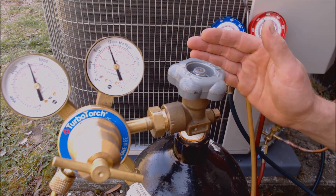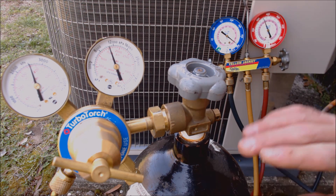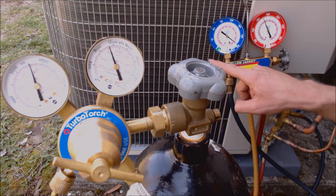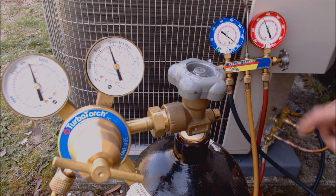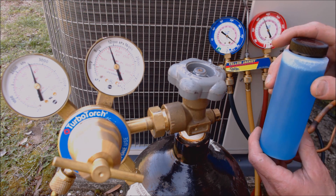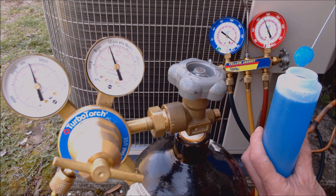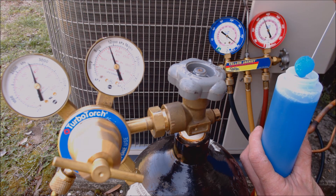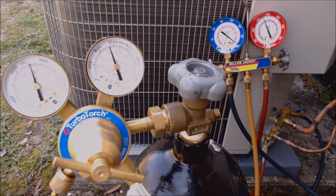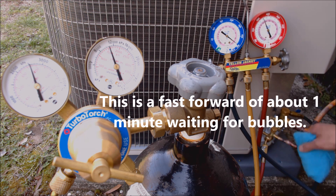After that, you can pressurize to a pressure below your max design pressure on the low side of the system. During the pressure test, just leave this alone as long as both handles are shut nice and tight. You're going to leak check with your bubble leak detector — I'm using a Rector Seal, which I have linked in the description below. It has a dabber that you can put on all your joints; it bubbles very well and finds leaks pretty effectively. I don't see any bubbles, so I'm going to go ahead and wipe that bubble leak detector off.